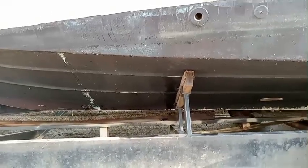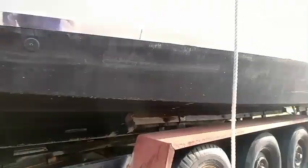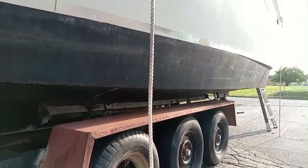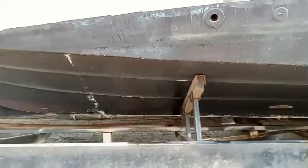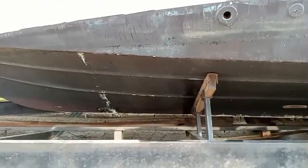So even though you might have a bilge pump back there, all the water runs forward in big boats. A lot of these boats — if you look — you're going to find a second bilge pump up forward. When you're checking your bilge pumps in the spring, make sure you check that front pump, because that's the one that keeps the majority of the water out of the boat when it's sitting level.